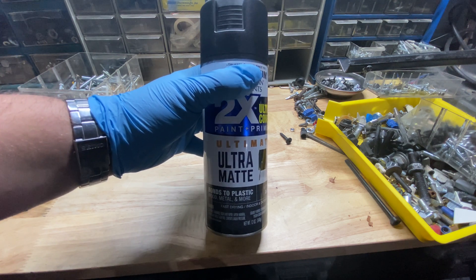Now that the furniture is dry and the temperature is adequate for painting, I'm going ahead and starting my first coat. Don't try and get all the paint on there at once — take your time doing light coats. Follow the instructions on the can as far as distance, overlapping coats, and dry times. Also try not to wear clothes that you care about, especially if it's a little windy — because I promise you, you will get sprayed. I'm speaking from experience.